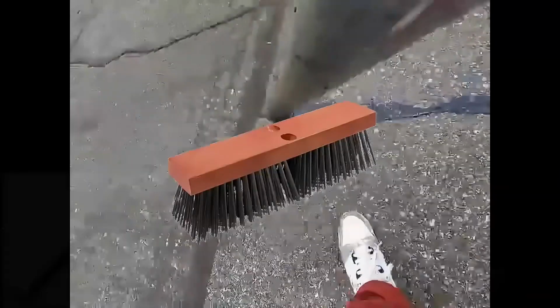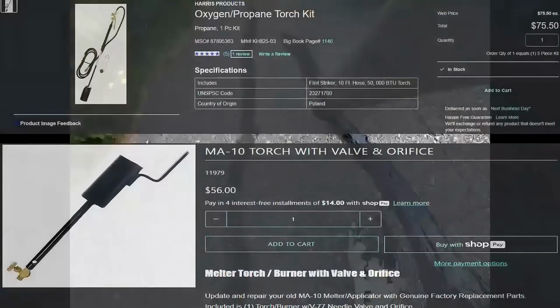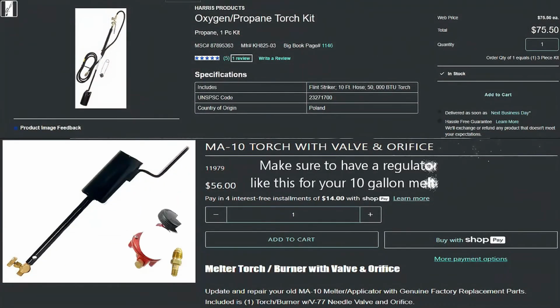So you're also going to bring your cleaning equipment: your whips, your blowers, scrub brush, your torches, all the propane that you need. You want lance head torches, and you want the regular torches. Really the only reason you need the lance head torches is because sometimes you have to clean these Cam 10s up, and it's just easier to use the fast torch real quick.